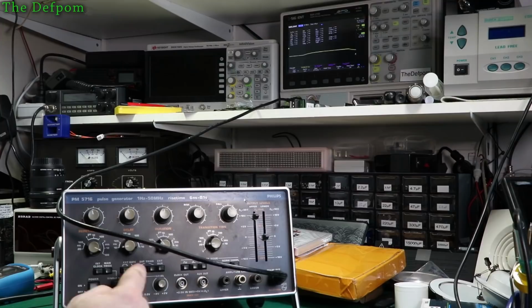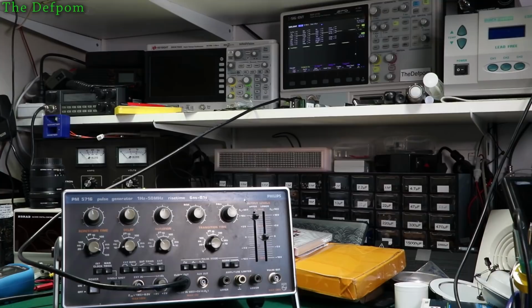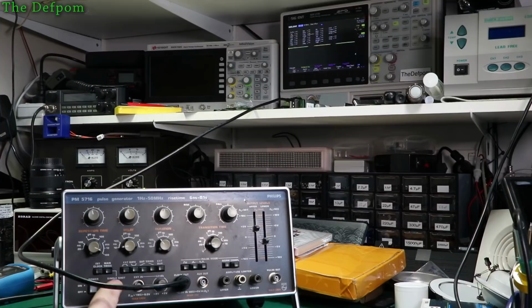I'll do those, it turns these ones off. But yeah, it's interesting. So let's chuck this in here, back on the clock. So you can see we're getting clock pulses at least. Alright, so at least we're getting that. That doesn't affect those, does it? No, didn't expect it would. We can do manual pulses. So that part's working.